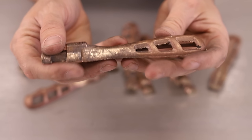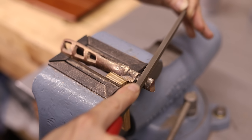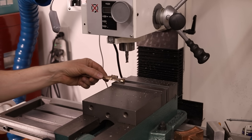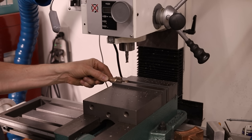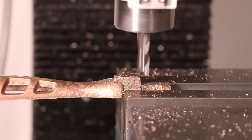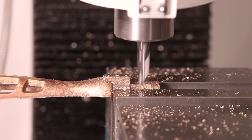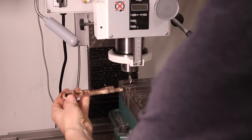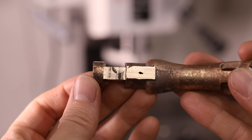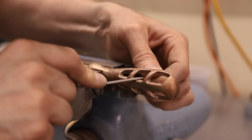I'll focus mainly on the insides and the cutouts until I weld them together. The originals have this little nub on the bottom that I think is there for some added strength. Of course I included this on mine as well, but it ended up being the thickest part of the castings, and because of that the metal shrunk as it solidified, leaving a little void on each one. No big deal though — I'll just fill them up with a little bit of weld.